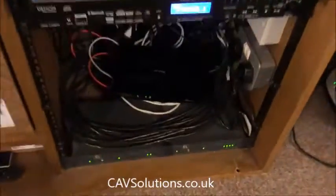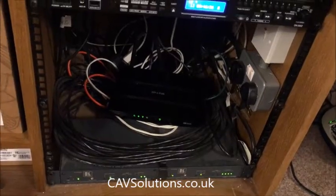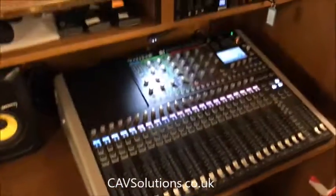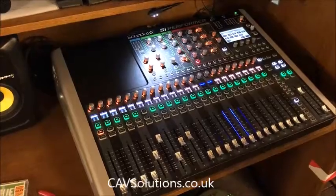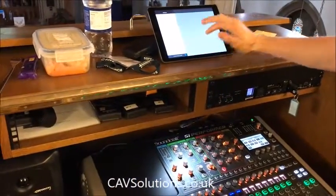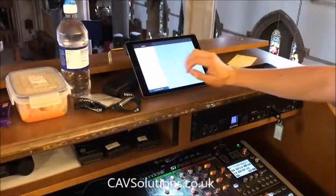That's obviously wireless. We've got a TP-Link just with one connection coming straight from the Performer. This is a brand new TP-Link router, default settings, nothing fancy, no internet coming into it, simply for control. So what we find is when we adjust VCAs and switch screens on the Visi Remote App, it causes both the Remote App to crash and the desk also crashes. It becomes unresponsive from anything that we do.